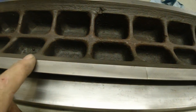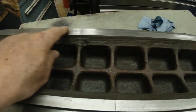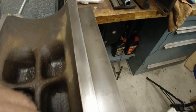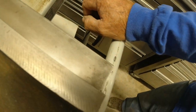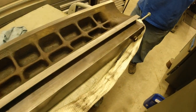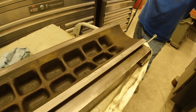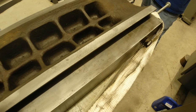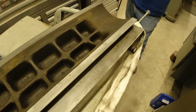Now this isn't a defect. They've relieved the center part of this about 20 thousandths. That happens a lot. And there's a void that was in it, or a chip. When you're looking to plane something like this, what you start off with is looking for hints, clues as to where the factory had it. Now, one of the clues that is not on this machine is flaking. They flaked the saddle, but not this part, which you see done a lot to make it look cool.